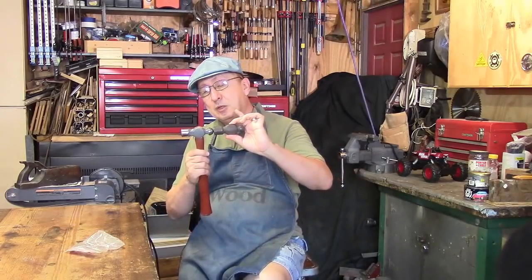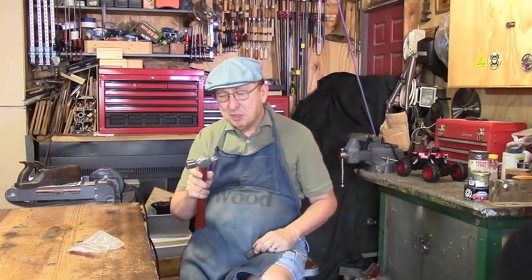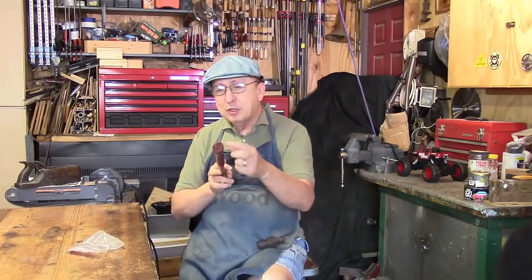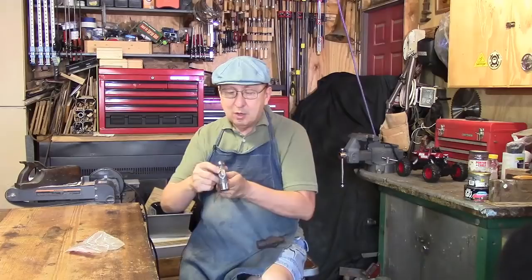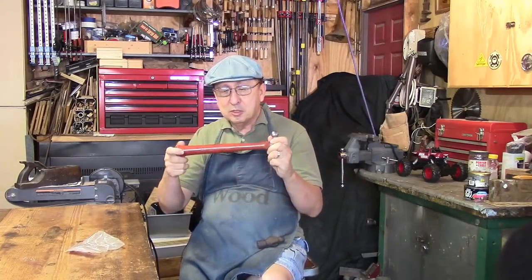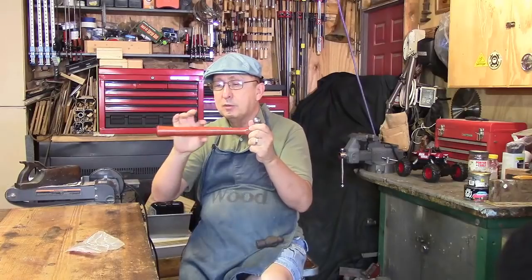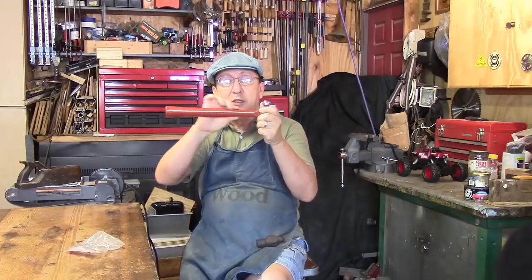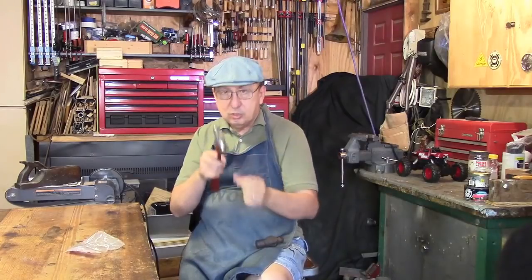It's very much like this one here. This is a 12 ounce Craftsman, and as you can tell it hasn't gotten much use — very good condition. But if you look at the hammer handle, you'll notice that it's oval shaped on both ends. So this entire woodturning was done through offset woodturning. It's heavy here, not quite as heavy here — actually slim here, almost straight. It thins down at this neck and then very thin where it goes into the head, and that too is oval shaped.